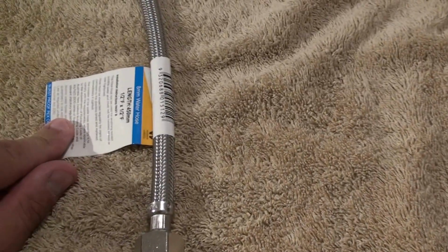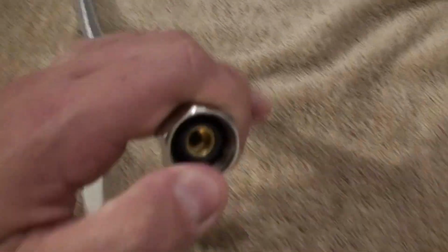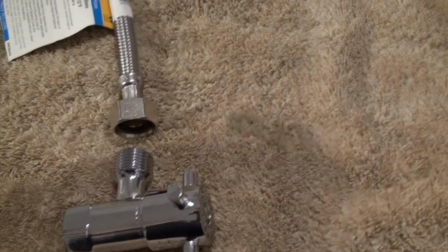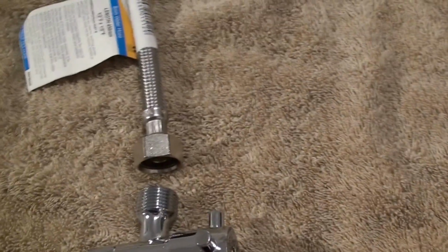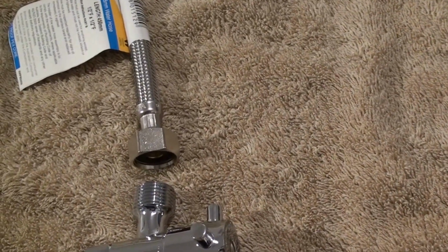Now, you will notice also on the manufacturer's instructions that they don't want these over tightened. You are then potentially jeopardizing the rubber seal. So what you'll see that they write on the instructions is that you do it up hand tight and then give it a 1/4 or a 1/2 turn further with an adjustable wrench or pliers.